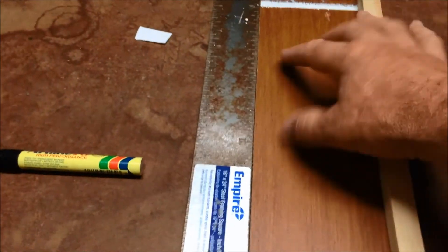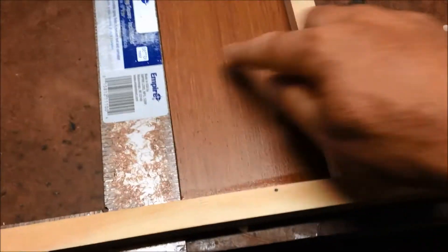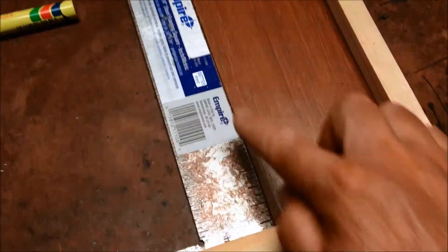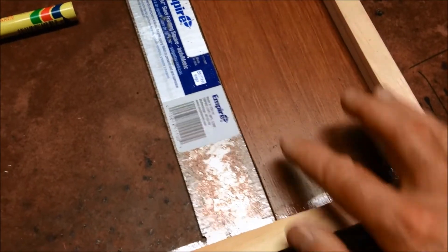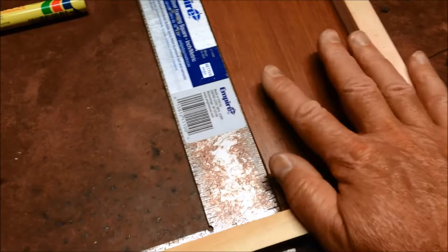The glue's dried on those bits pretty well. Next I need to cut this one to length, cut another one to length, then glue them in. Once I've done that I'm going to cut in a couple of little cross braces here and here, leave this section open with a screwable plate, and just glue in a square section here — another bit of ply just to make it a nice strong double-sided part on each of the ends.